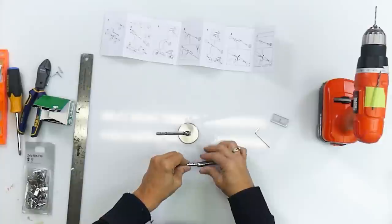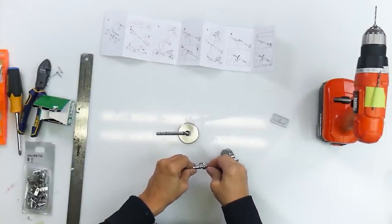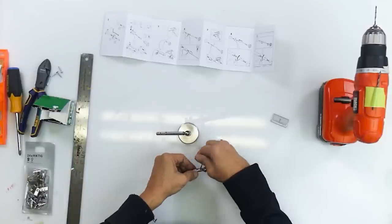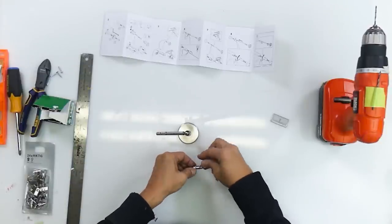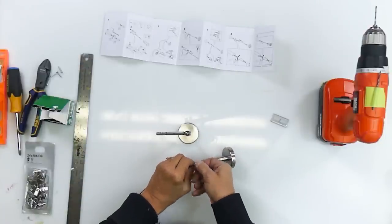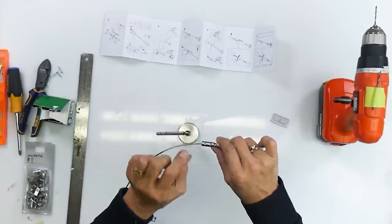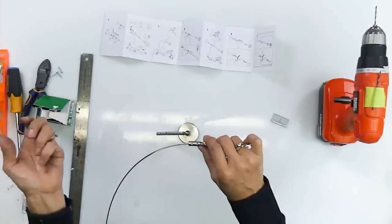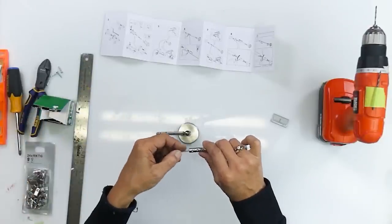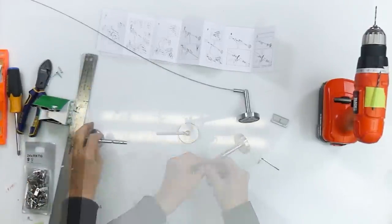And then you're going to tighten it with this little piece again. Start with the innermost one. I'll tell you why. Because if you tighten that and just go as tight as you can, within reason, you don't want to break anything. If you caught the wire, you see it's secure. If I had done that inner screw and it came out, that would mean I didn't push it in far enough. So you do that one, you tighten it, and then you tighten the second one.